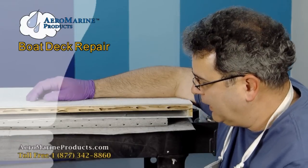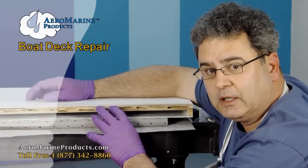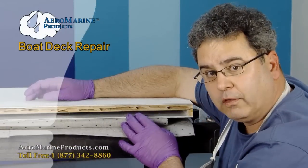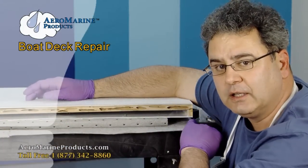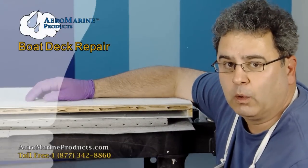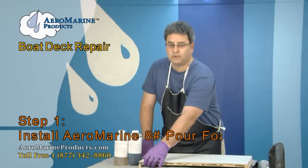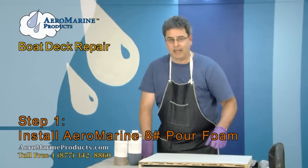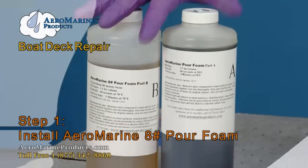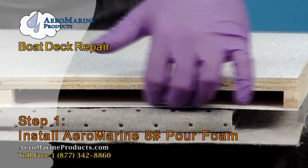The reason for that is that we want to ensure that we do not overshoot this area when we're injecting it with epoxy and fill up this area with epoxy. What will happen is this epoxy will run down the sides of the boat, run down the sides of the headliner, and run down the sides of your boat — not only wasting the epoxy, it'll make a mess inside. The first step in the process is to install the foam as a backing in the void so that when we work with the epoxy, we're working with a solid backing. The foam we're going to be using is the 8-pound density Aeromarine pour-in-place foam. This is a very dense structural foam and it will tie these pieces in as a single unit.